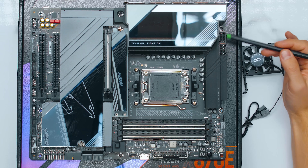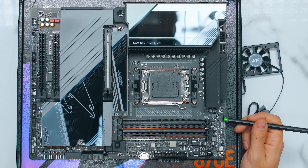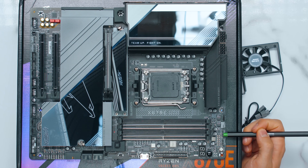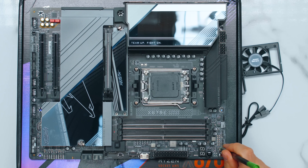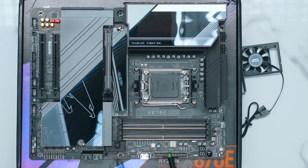Let's take a look at the motherboard headers on the top: two 8-pin EPS power connectors, some fan connectors — CPU optional and CPU fan — five volt ARGB, another five volt ARGB, reset switch, power switch, debug LED for error codes, and the 24-pin power for the motherboard.